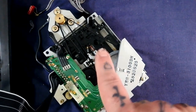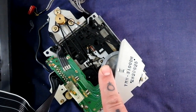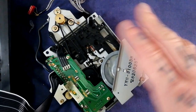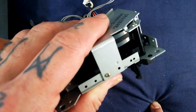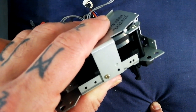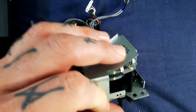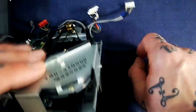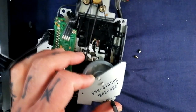For the purposes of repair, we don't need to intimately understand how all this stuff works. It's more a matter of: is it clean? Is it lubricated? Are all the teeth, springs, and clips present? Has someone else been in there and lost a part? It's like a fitter in a tyre and exhaust shop - you can identify a faulty exhaust and change it without having the same understanding as the person who designed the car. I'm trying to get this plate off so you can get a clearer look at the mechanism - and this is a necessary step for changing this belt.